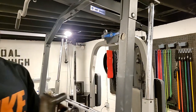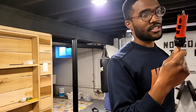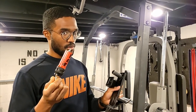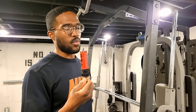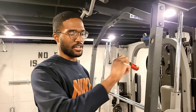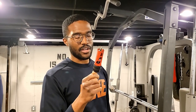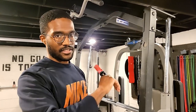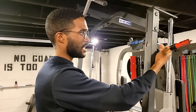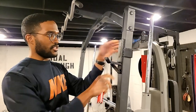In order to do that — this is what I was grabbing from the garage earlier — I used these drill bits. This is a Diablo metal carbide teeth, 1-inch hole cutter for cutting into metal. A couple quick tips: you want to lubricate the surface that you're cutting because the metal-on-metal contact creates a lot of heat and can make the blades really dull. I sprayed a little bit of WD-40 on there. Long story short, measure twice, cut once. You just want the hole to line up with the bottom of the hole in the back so you're able to put your J hook through.